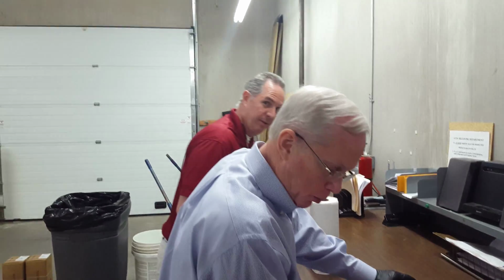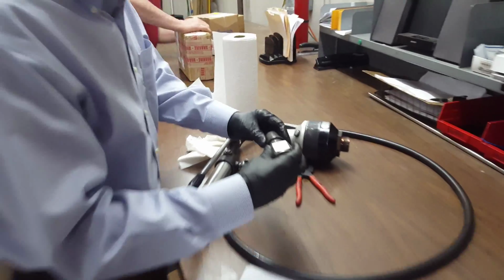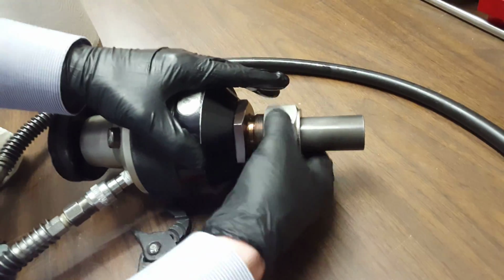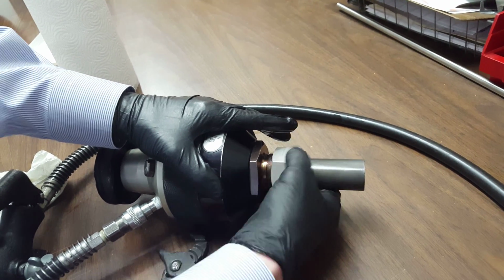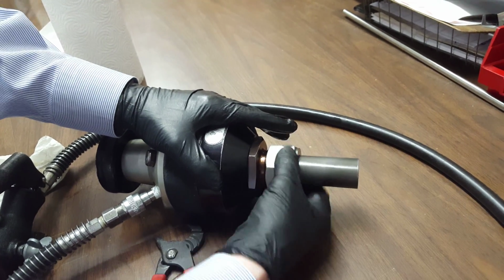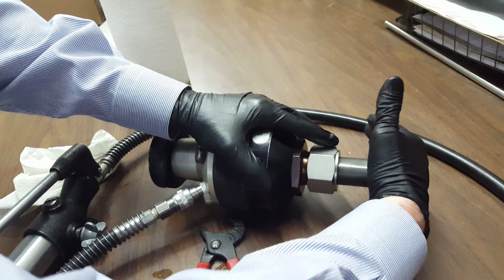Alright, on the swaging procedure, we want to put the Swagelok nut and ferrules in the proper sequence. This is where you want to follow the rules when you open up the fitting, Dayton, regarding the application of the lubricant on the rear ferrule. We're going to thread that, make sure it's bottomed out, and thread the nut down all the way till it stops. In the past, by the way, Dayton, it wouldn't be a bad idea for whoever's doing the work to make sure they push down on this tube in the direction of the die head itself. Once we get the threads fully engaged, we're going to push the tube all the way in.